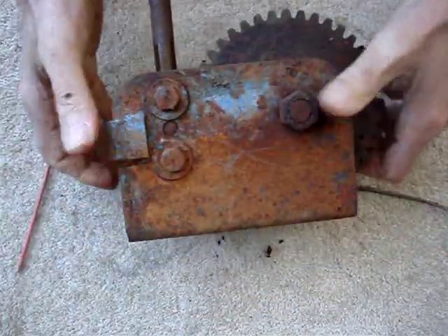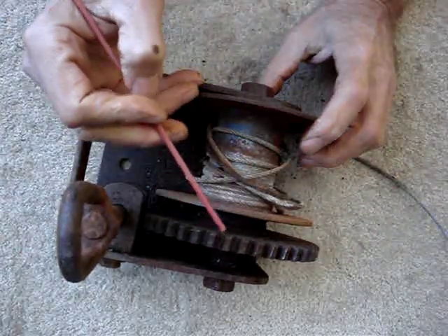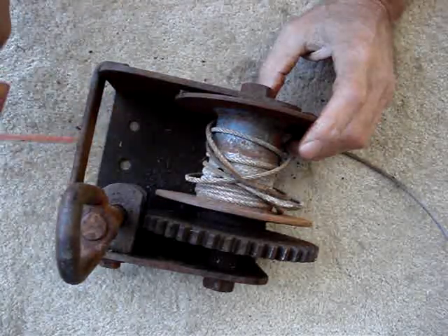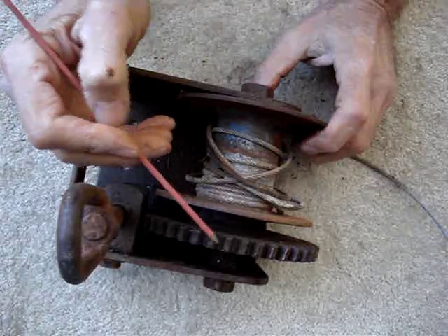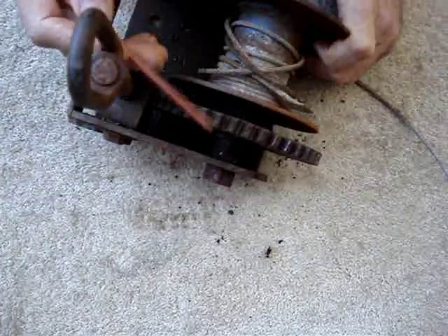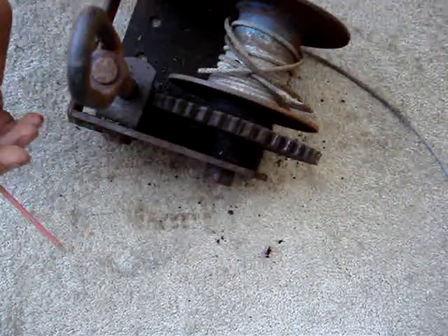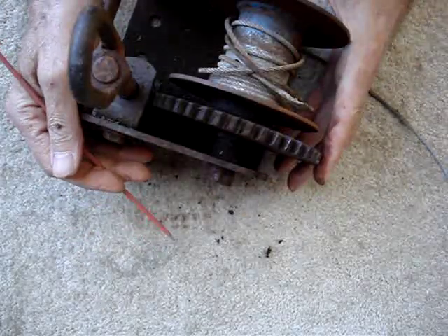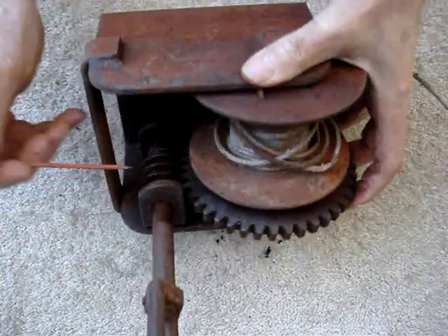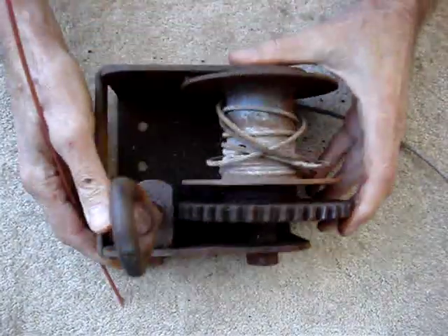This is a glamour winch. It has a solid gear — these are really rare these days. It's about three-eighths of an inch thick and cut on a slight angle; it's not a regular spur gear, it's slightly helical — maybe five or seven degrees. So it's a solid helical gear that mates with the worm, which it does do nicely.